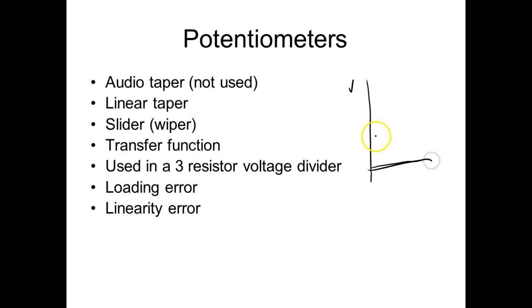But what we mean is if this is ohms, and then this is degrees, then depending on how the pot's set up, depending on which one we use in one and two, that's what varies. Which one do you use for the positive? Do you use one or do you use three? It doesn't make any difference. All you're doing is changing the angle of the slope, right? You understand? So one angle, I might have it like this. The other one would run like this. And this right here might be 350 degrees. Now, what determines the angle of the slope?